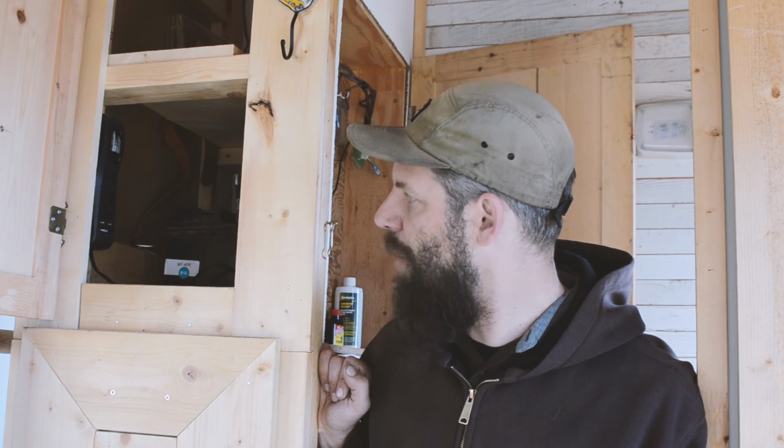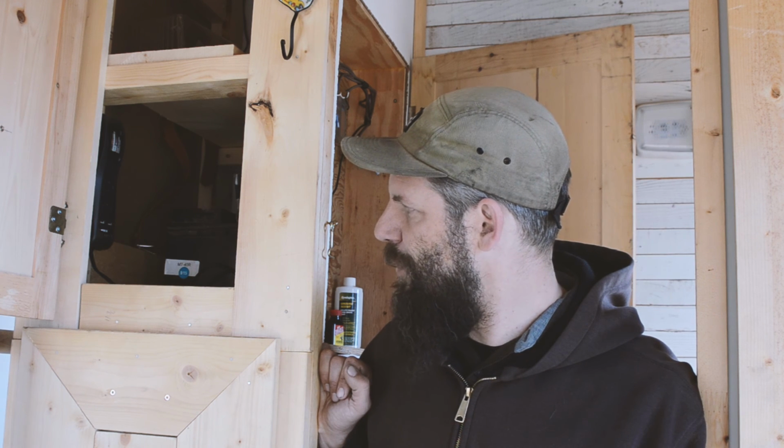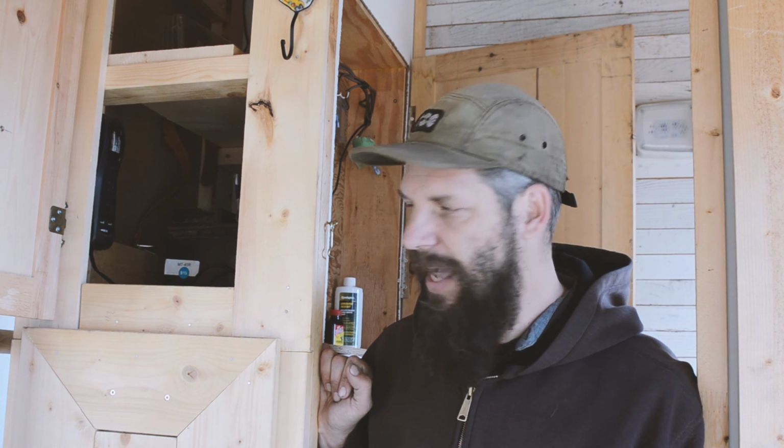So I would like to build a little box around that battery and vent it to the outside the same way the battery is vented in my trailer. So we're going to try and build a little system to vent that box out. Now luckily hydrogen is much lighter than air, and so it wants to escape anything you put up. So that's what we'll do. Then the other thing in there is proper terminal connections and getting fuses between things and that sort of thing.